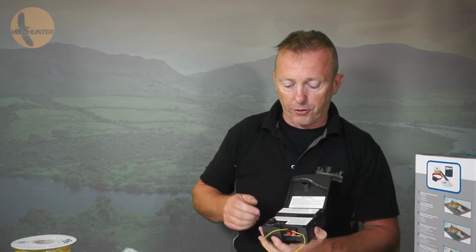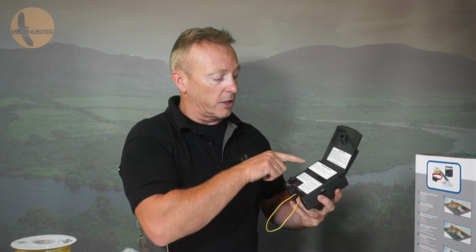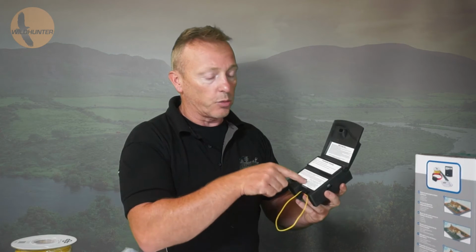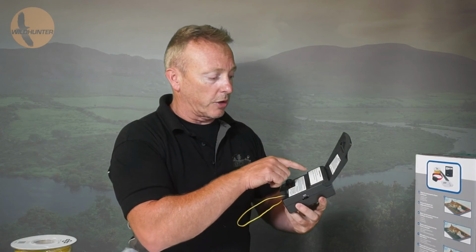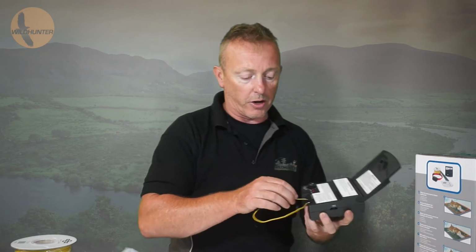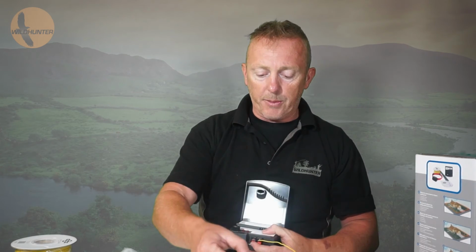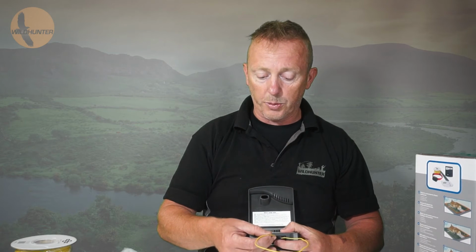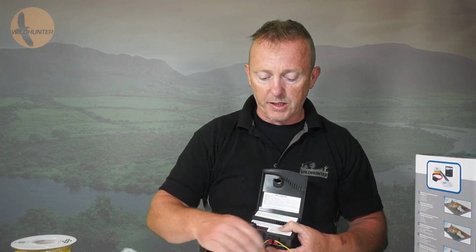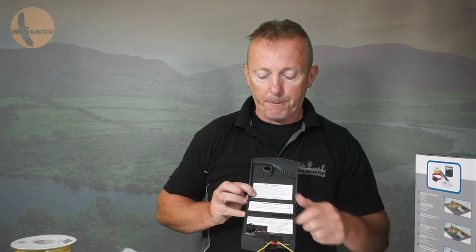The box itself, the transmitter box, is fairly straightforward. As they say, it's called an idiot-proof transmitter box. It's from 1 to 5, actually 1 to 6. Step 1, as you do with your control, connect the boundary to the red terminals. When I'm setting it up to show a customer in the shop, I just do it on a little demo, and I tell them to do this at home if they think there's a problem with the box or somewhere. The wire could be broken. All I do is set it up like this, straightforward, and I just copy the steps as I go along.